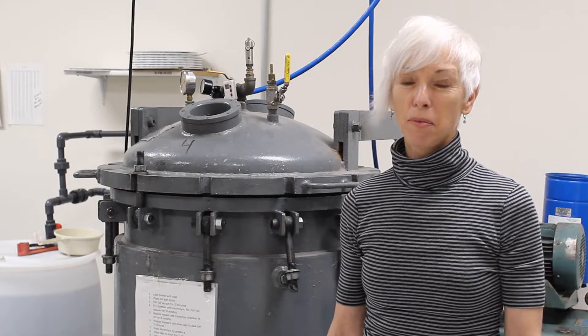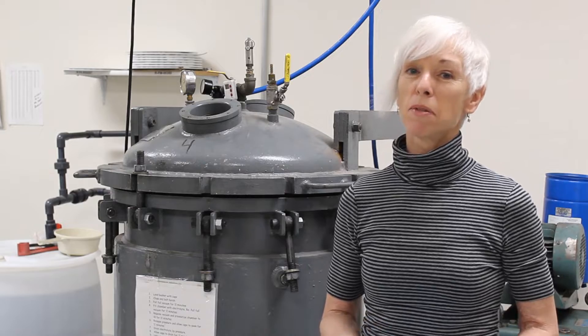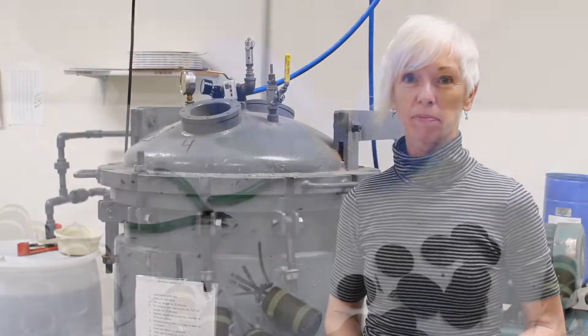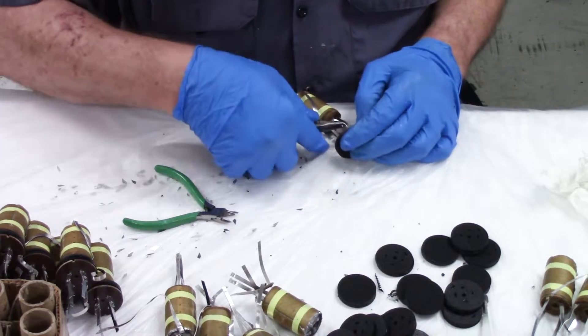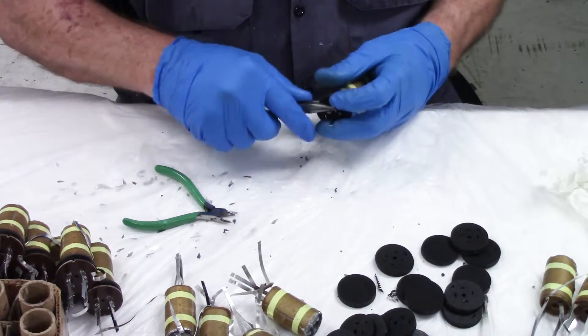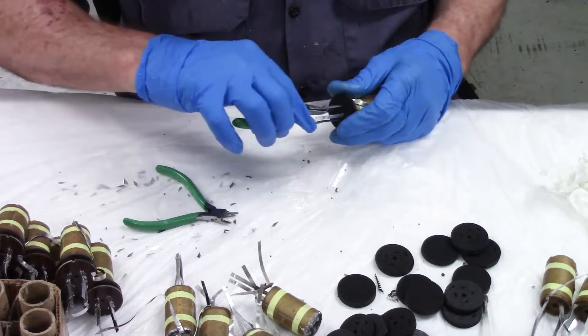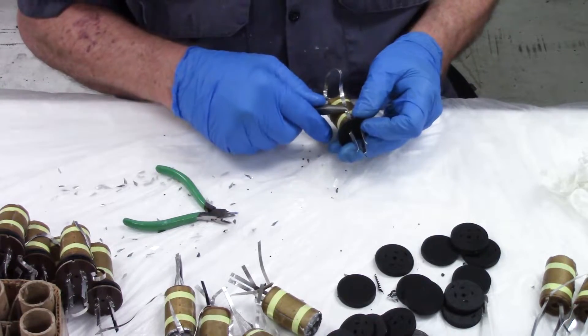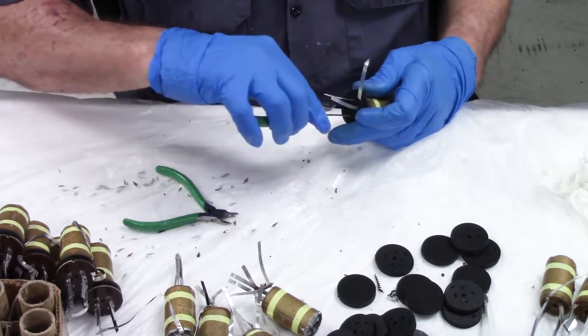The capacitors are now fully impregnated, and it's time to finish their assembly. The first step is putting on their cap and gasket. The gasket assembly is made with soft rubber on one side and a rigid plastic on the other. Pete carefully feeds the anode tabs and the single cathode tab through the tight slits in the rubber, and pulls the tabs up through to the top. Once the gasket's in place, Pete puts the cap on.